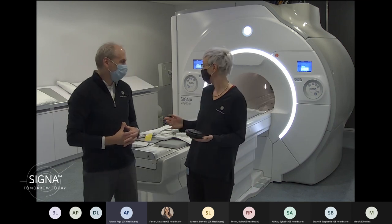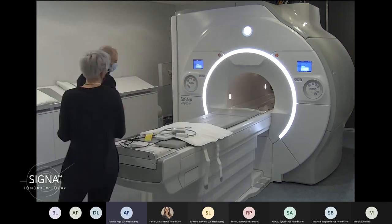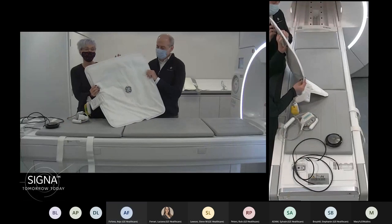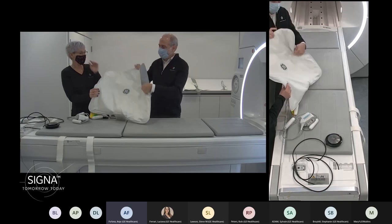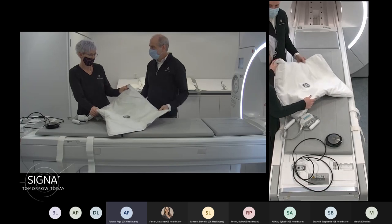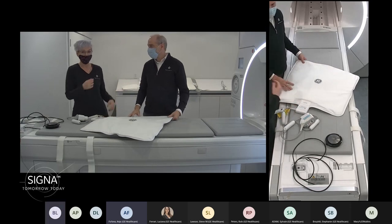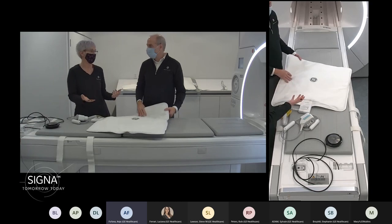We are really excited to show you today the AIR coils on the Voyager scanner, and we just want to go over and show the coil itself. Here we have the AIR-A coil available for the Voyager scanner, and you see it is the same as our other AIR coils — it looks like a blanket and it feels like a blanket. So you can easily twist and turn it around. It's really, really flexible, and that is why we are so excited to scan with these coils also in Voyager, because that really opens up so many opportunities, especially in regards to MSK scanning, which was always really challenging for an MRI tech before.